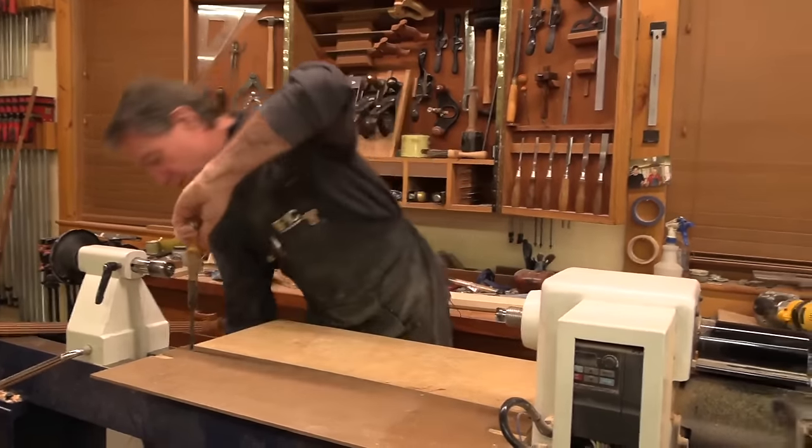If you don't have these or you can't find the right size, you can use a dowel. Often I would just blunt the end of the dowel and wrap it with sandpaper and get up in there, and you could knock that off fairly rapidly. A quicker process is, if you have the right carving chisel to conform with that cove, you can very subtly skim it right at the end. You're going to be coming from the high side down, obviously, and then lightly detail and sand it. So you've just got to work out a method. There again is a great reason to have the practice piece first and get your approach dialed in before you go to the good stuff.